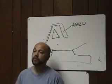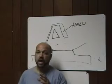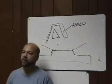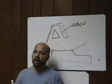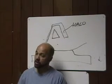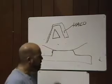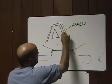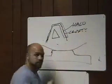In this case I think we also have too much pressure between the anilox and the plate. That would be fortunate because we can just back out. The good thing about the sample is we get to talk about how do you know when you have too much ink. If you have a light impression with no halo or little halo and it's printing, you can actually go in or out of the ink sometimes and still not affect things. So how do you know when you have too much?